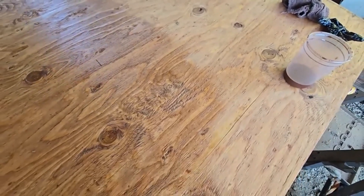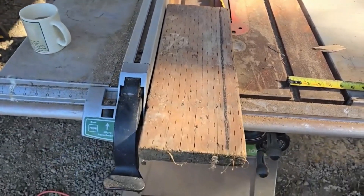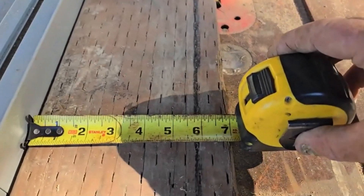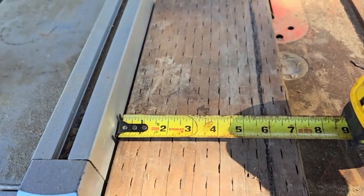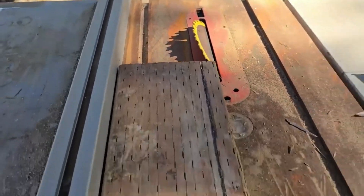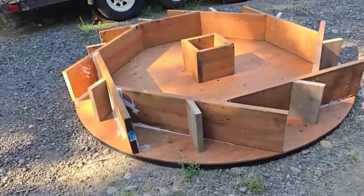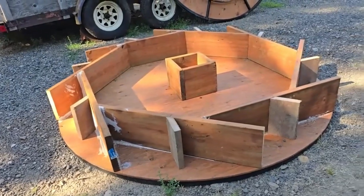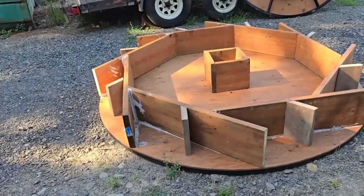With the advice of a few people I doubled up the buckets on my wheel. I took a two-by-eight pressure-treated board — it's right on seven inches. I put the table saw at a 45, ripped it down, then cut the two-by-eight to match the lengths of the two-by-twelves already there, and put it vertically to double up the buckets. Now we're going to silicone them in.